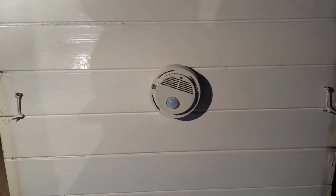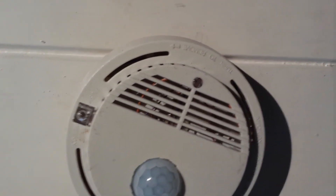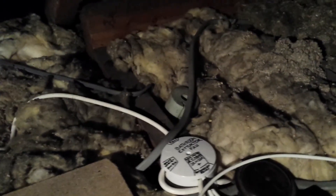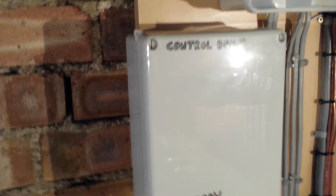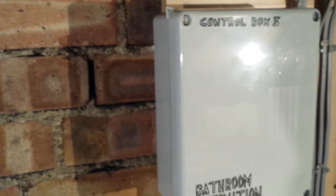That is an old smoke sensor which I had adapted to have the movement sensor there, and the light sensor just over there on the top, as you can see. From there there's a wire that comes from the back right there, goes to a box at the back of that junction box, and obviously that cable comes all the way back to the box, which takes the signal back down to the Arduino, which then sends back the signals for the relays.